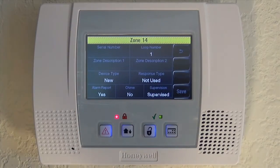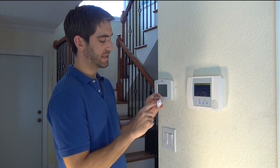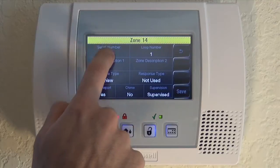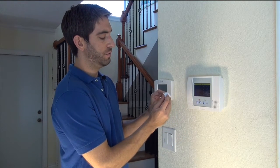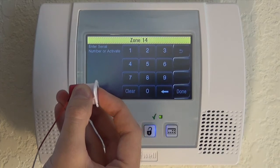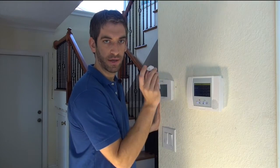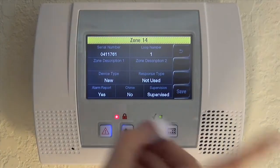Toggle it and click Edit. We're going to use this on our garage door. The first thing we want to do is learn in the serial number. On the 5800 RPS, since it's a smaller contact, they put the barcode sticker with the serial number on the antenna. You can see it's got the A for alpha, and then your seven-digit number: 041 1761. Toggle into serial number — you can either key in that seven-digit number, or easier than that, you can do the auto-enroll mode. You activate the sensor three times: plunger switch pushed down, open our door once — it beeps — close our door, open it again. It learns in automatically the serial number and the loop. You always want to use loop number one for a 5800 RPS. Then a third activation: close our door, open it. It saves in that information and takes us back to our zone screen.